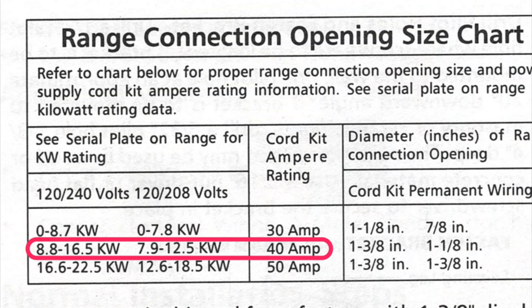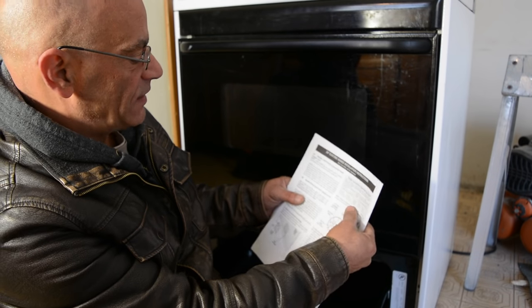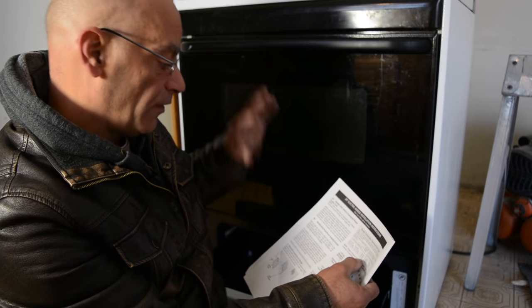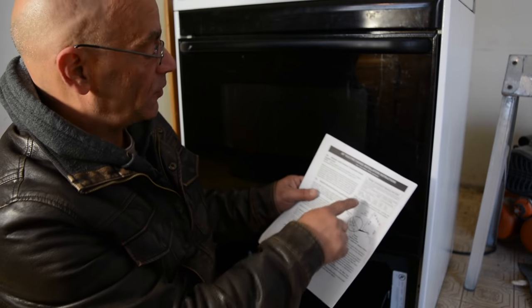Lucky for us — if we had one somewhat higher, then we would go to a 50 amp. But obviously this unit is not going to pull enough kilowatts for us to say we have to do a 50 amp service. Maybe not for you though — if yours is higher because your wife wanted that unit with the extra burner in the middle that you're never ever going to use, well, you just went through a lot of work and money for that burner. So let's get our three-wire put in. We're going to take our wire from our old stove — it looked pretty good — and we're going to put it in here.